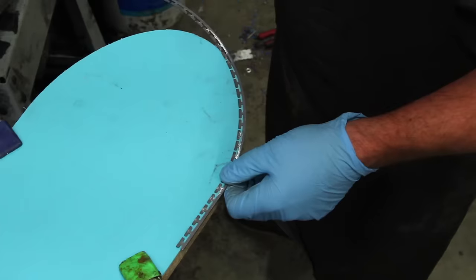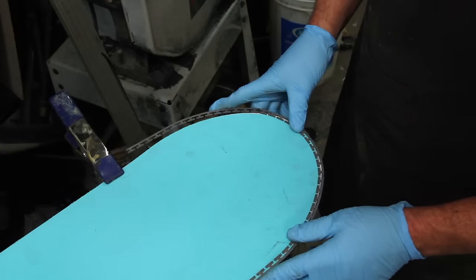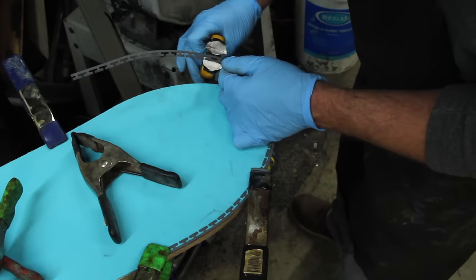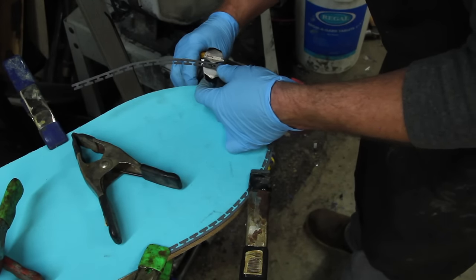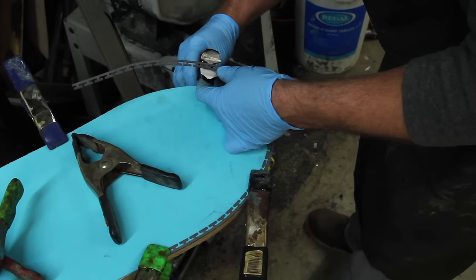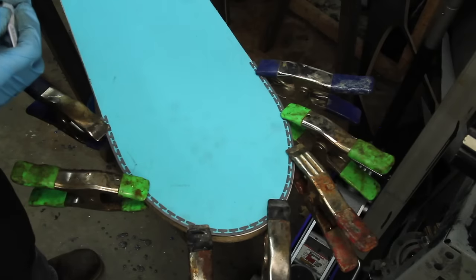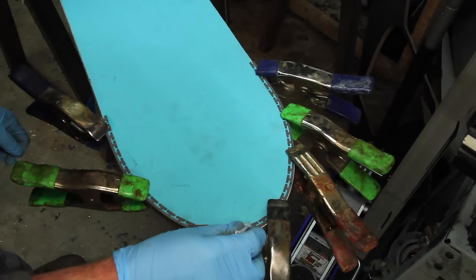It's really just a process of bend a little, check it, bend some more, recheck, and keep tweaking. I'm making the final fine adjustments with a modified set of nippers. They're ground down to either bend or straighten the edges needed depending on which way you hold it. Once the edge fits tightly, a few drops of super glue tack it in place temporarily.